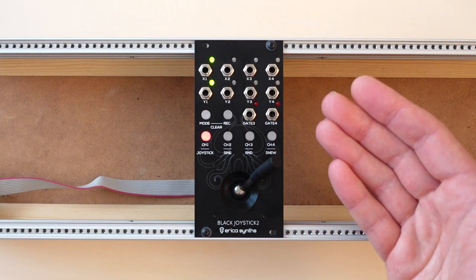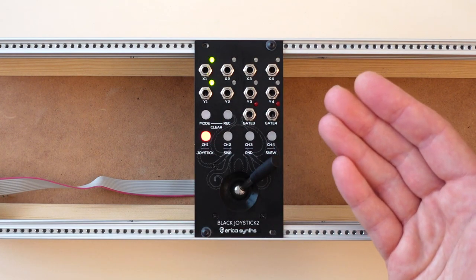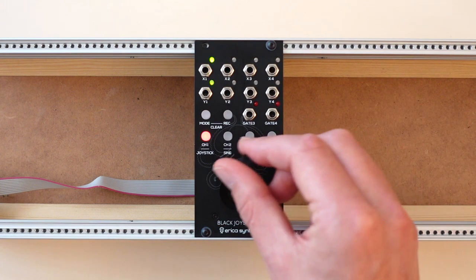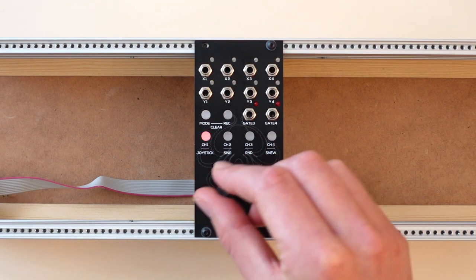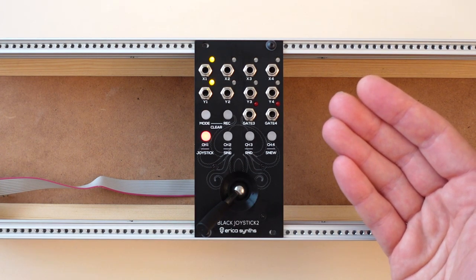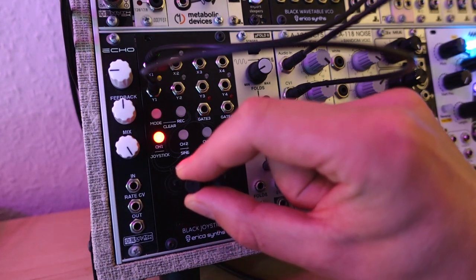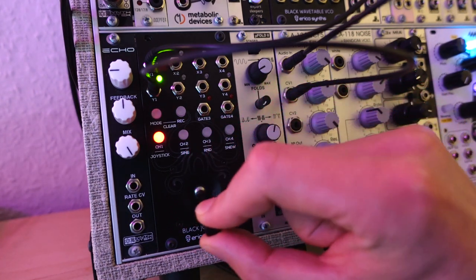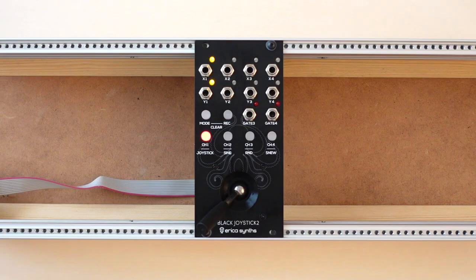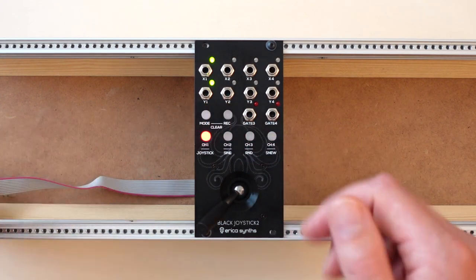If you move the joystick when a recorded movement is playing, the joystick overrules the recording with a bit of slew from the recorded value to the joystick position, so the change feels organic. If you stop moving, the output value is returned to the recording, again with an organic transition. If you want to clear the recording, just press and hold mode, and then press the record button.